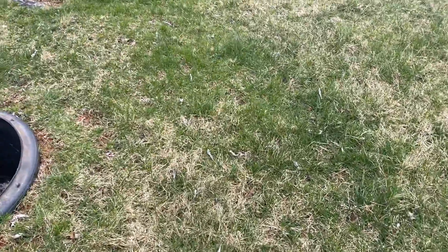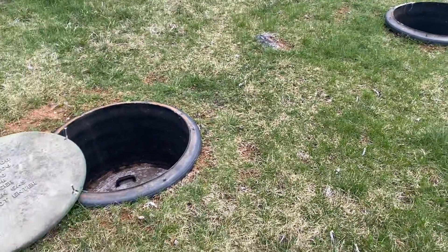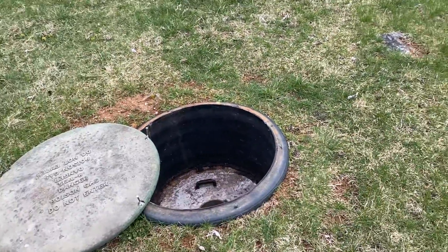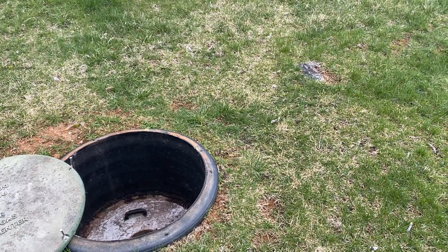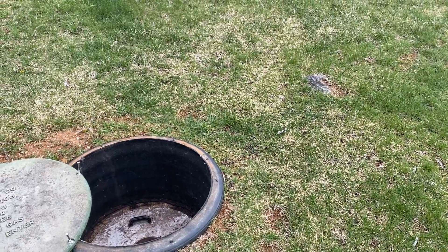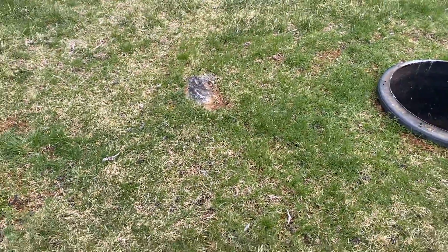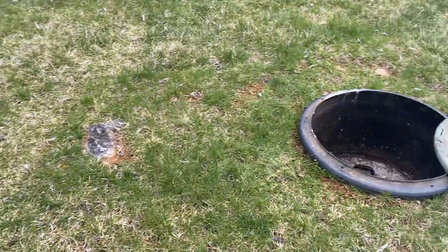In our area, most modern septic system installs are going to have a two-chamber septic tank. What that's going to look like is you'll have the front chamber here, second chamber over there. It's just a large concrete box, and what will happen is as you flush a toilet, run a sink, bathtub — you name it — all of that wastewater will go into the front chamber. The solids will fall out of suspension into the surrounding chamber itself, and then there'll be a concrete wall to where any of the floating debris known as the scum cannot get into the second chamber.